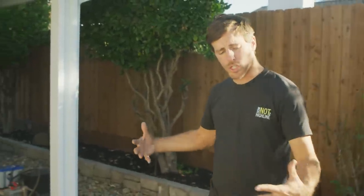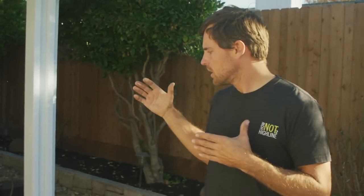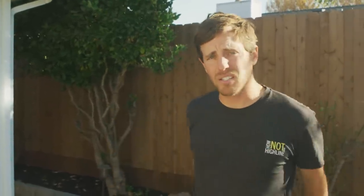Because look how much stretching happens, right? It's really interesting to see visually what happens during the process and not just the final number. We'll see at what point these deform. It could be anywhere between 4 and 8 kilonewtons. And that's what we're here to find out, how the metal reacts.